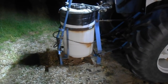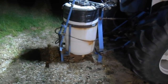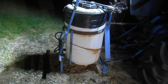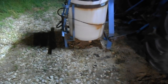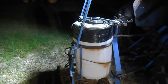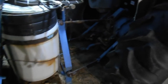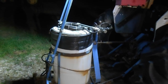When I put the tank up last year I did rinse chemical out of it, and the chemical that was in it was Liberty Link, which is what I'm going to put back in it. But this tank sweats — I covered the top with a trash bag trying to keep rainwater out, but it's condensation. There's an inch and a half in the bottom with green stuff in it, so I've got to rinse that out, take apart and clean every sprayer nozzle, mount the remote control arm back on the fender, and put the PTO pump together on the PTO. I probably got a good hour and a half here before I even get started.